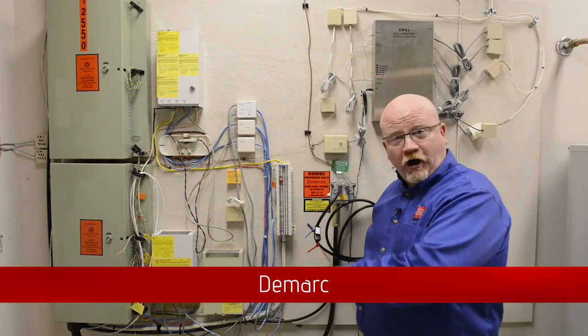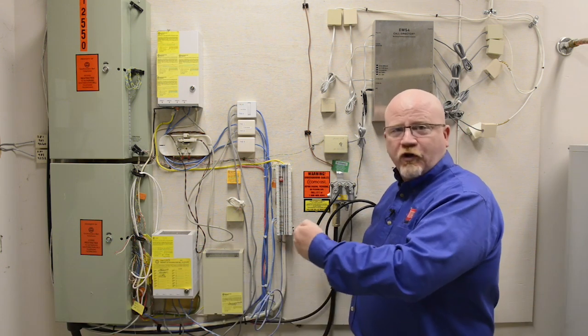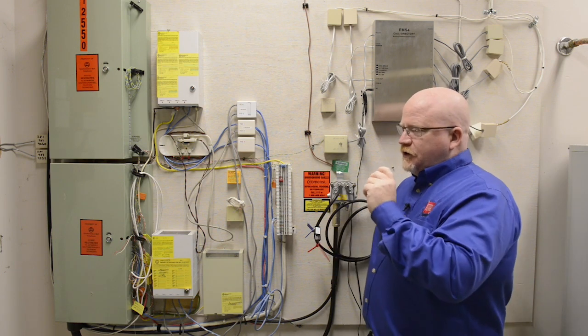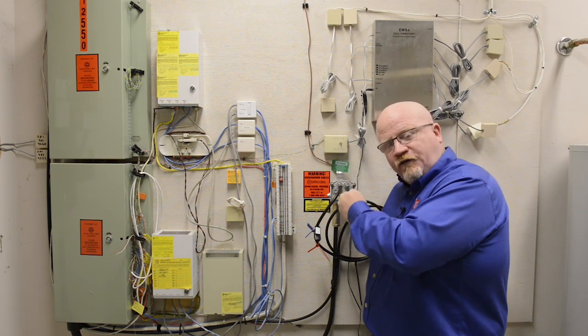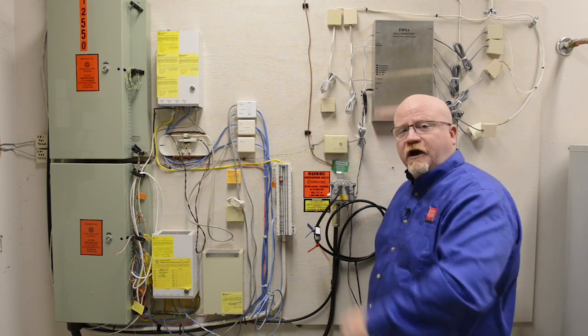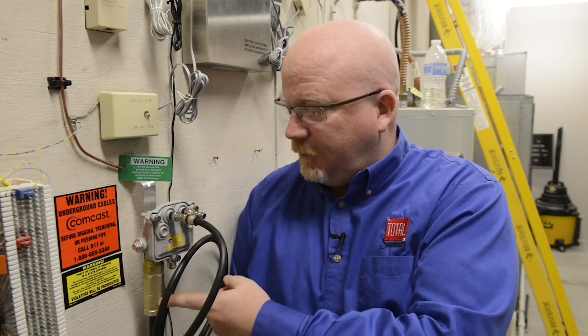Welcome to the DMARC for my office building. The DMARC separates that which is the property of the phone company or the cable company versus what's yours. What we're looking at here is a bunch of equipment owned by the phone company or cable company. Typically the DMARC separates the telephone company's equipment from yours, but this is a leased building, so things are a little bit different here. This right here is basically a multiplexer or splitter that comes from the cable company — we've got a big chunk of coax coming into the bottom, and this little splitter is designed to service four different customers. If you're going to be doing cable, you need a cable modem. Typically in the DMARC area we would have a cable modem that would act as our true DMARC, but because this is a leased office with offices all over this building, we cannot end the DMARC right here. We actually have to run this cable over to our office and create a DMARC extension.